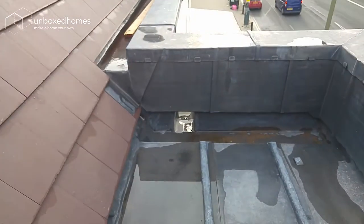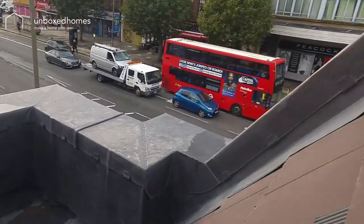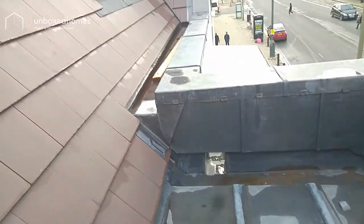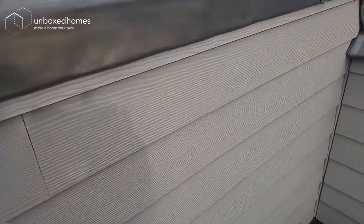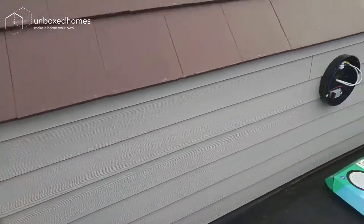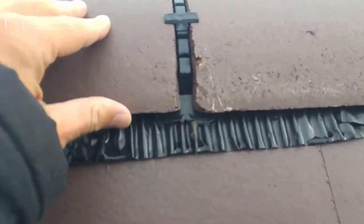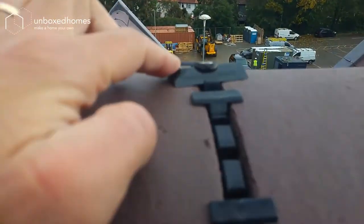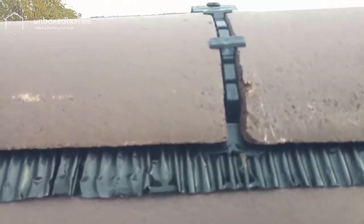There's some nice lead work there — it's good to see neat lead work, and this is nicely encased too, with a nice roll off onto the gutter. It all looks pretty much of the best. Here on the roof terrace you can see a fantastic view for these lucky people. There's quite interesting cladding — it's actually a fibre cement board — and they're busy putting in some lights. There's also an interesting ridge tile fixing system I haven't seen before. Normally it's pointed down, but they've got this kind of fixing system which possibly makes it last longer. It's not plastic — I'm not a particular fan of plastic.